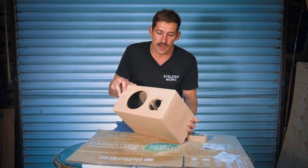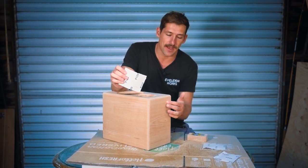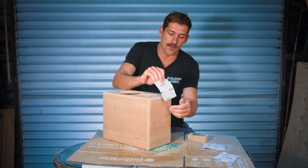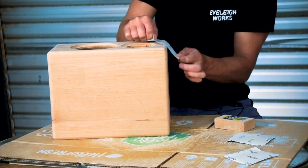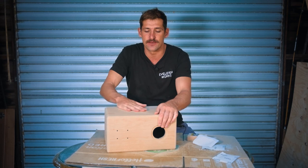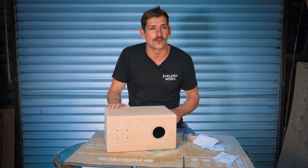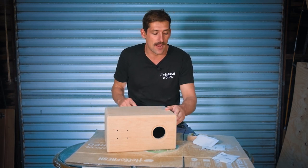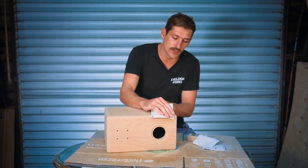Just keep in mind — you'll notice the top panel. Be very careful that you don't touch that adjacent panel, because you'll notice the grain pattern goes a different way, so you could put scratches into it. Avoid doing that. I'd recommend just holding the sandpaper this way and doing passes along the grain. Once you've done 120 grit on all sides, dust it all down and get rid of any excess dust — you don't want any 120 grit particles remaining on the wood. Then get your 180 grit, count your strokes, do 10 passes, and then go to 240 grit as the final grit to get it really smooth. Do that blending trick on all your sides as well as you move up through the grits.